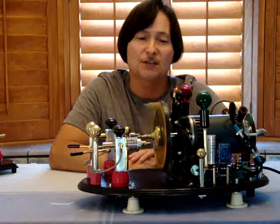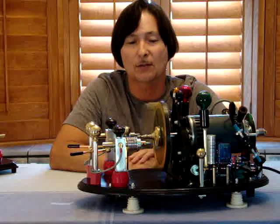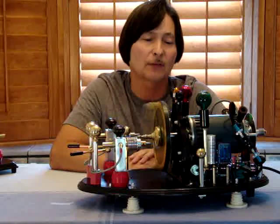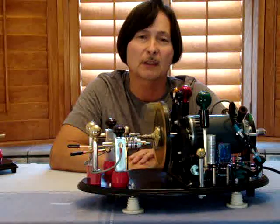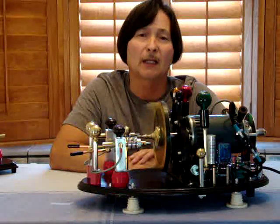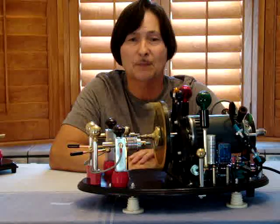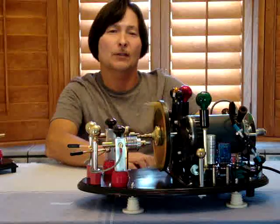It has a braking system on it, so everything comes down as much as possible. The motor spins for a long time before it finally comes to a halt, but the braking is about 50% on the motor — it puts the capacitor back in the circuit for a braking action. So that's my presentation. I hope you enjoyed it and have a good day. Thank you.